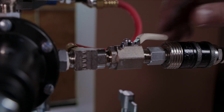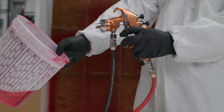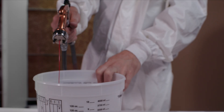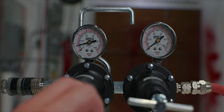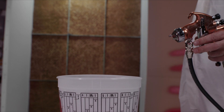No air should be flowing to the spray gun. As a good starting point, set your tank's fluid pressure regulator at 10 psi. At the spray gun, aim the gun's fluid end into a paint can or waste bucket and pull the trigger. The pressure tank will now begin fluid flow. Hold down the trigger until a fluid stream emerges from the fluid nozzle. Depending on the hose diameter and length, this can take a little time. You can increase the pressure on the fluid controls to force fluid to move faster, but prepare to back it off once paint emerges. Adjust the fluid pressure until you have a horizontal fluid stream that extends between 6 and 8 inches long before gravity bends the stream down.